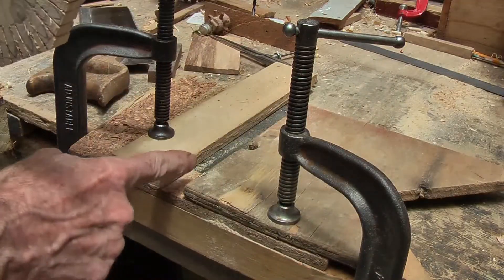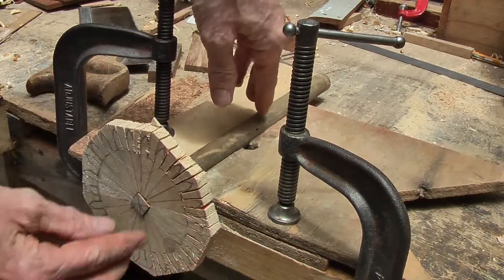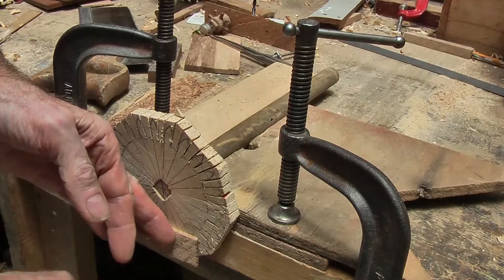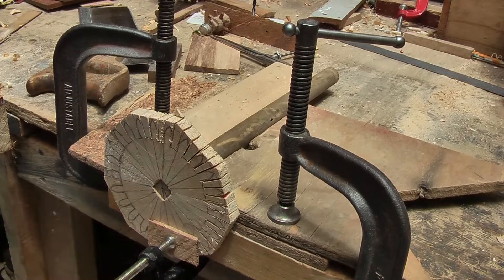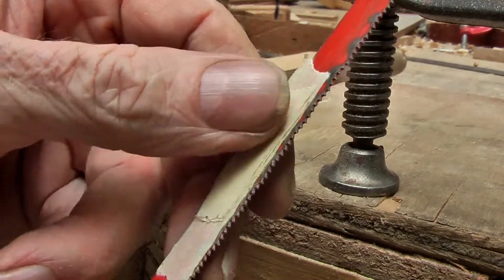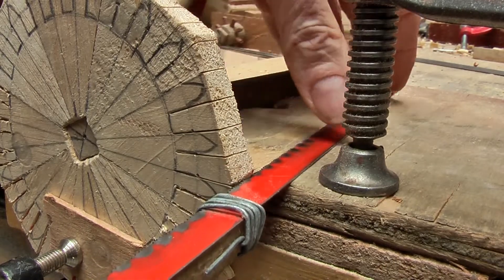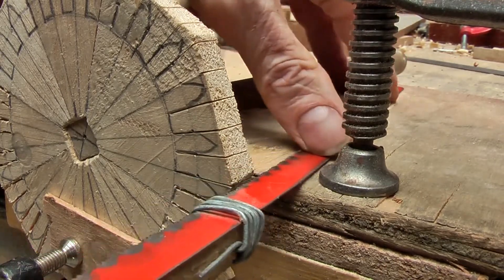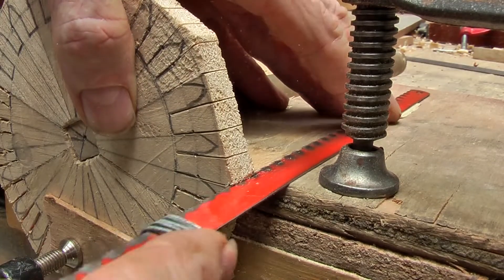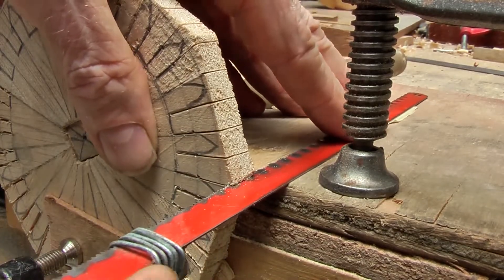Putting it on its axle, I have a board with two boards clamped to that and another one underneath so it sits in there and I can clamp that. On my blade I have put a few layers of tape just to compensate for that kerf there. And I am laying it on the table flat and that will very carefully go down the line into the gap on the inside line to cut out the gap leaving the tooth.